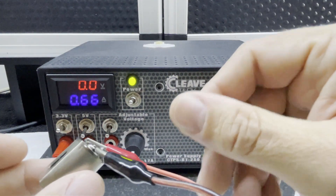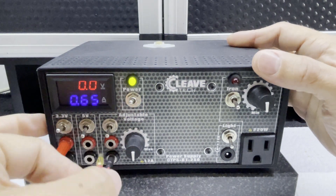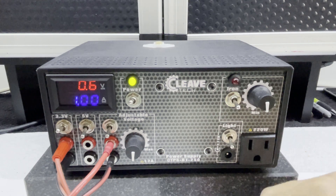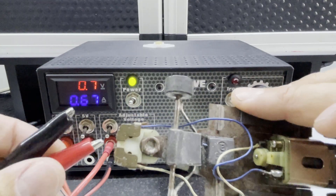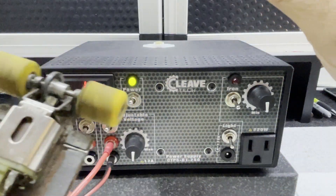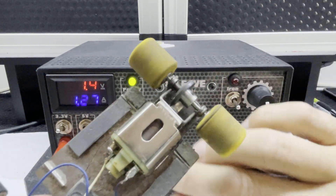So as well as the 3.3 volts running, you could also plug into the adjustable voltage. You could be running this motor at 3.3 volts, running it in. But then again, you might want to just test another motor or power something else at the same time. So I'm also going to connect the variable voltage here and turn that on. You can see I've got it connected right down low — that's rotating very slowly.